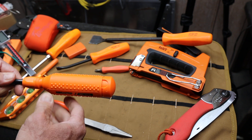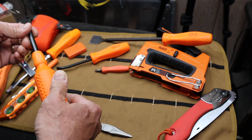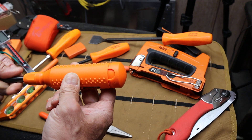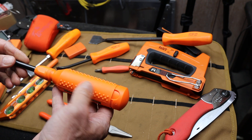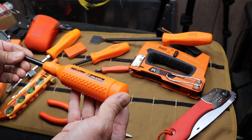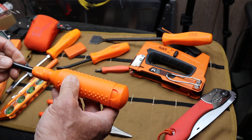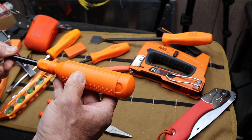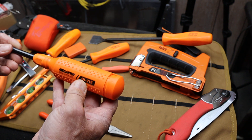The handle is ABS plastic — they call it Triax. To me it feels pretty hard and pretty slippery. ABS plastic is often not used in a lot of tools because it's sensitive to ultraviolet light, so if you leave the tool out in the sun it can affect the brittleness. ABS is known for being super tough and very abrasion resistant, but it can get brittle and crack.